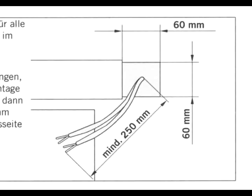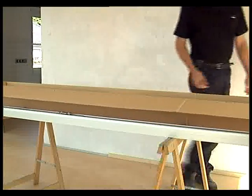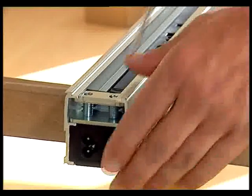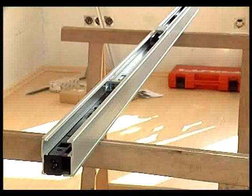In case you prefer permanent power supply, you first have to remove the power outlet inside the operator. In order to do so, please relax the screws of the end stop on the side of the control unit and move the end stop to the center of the operator. Neither remove the end stop nor screw it tight.